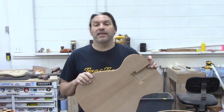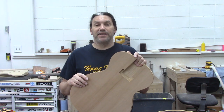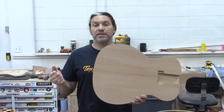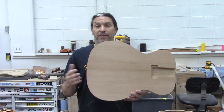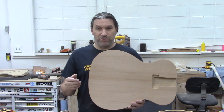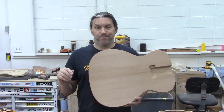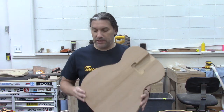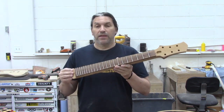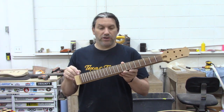You don't have to bind — lots of acoustic guitars are made with no binding — but some people think binding classes things up a little bit. You could use wood binding; if you're bending the sides it's a good opportunity to shove the wood binding into the bending unit and bend that too so you don't have to worry about the binding cracking. But we're going to use plastic binding because this is a bit of a prototype instrument and I wanted to have the Gibson-style raised nubs on the side.